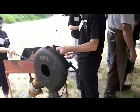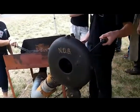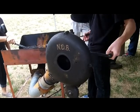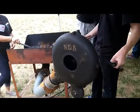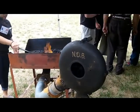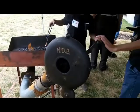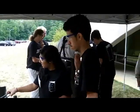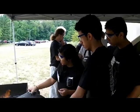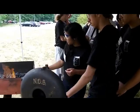Now, what's this here? It's a coal fire. The blower puts the air in from below and up. The fire doesn't get all that hot without forcing in the air, but start the blower and it gets very hot in there. It easily gets hot enough to set the metal on fire. I saw that actually. Yeah, you get a Fourth of July spark and your piece is ruined.